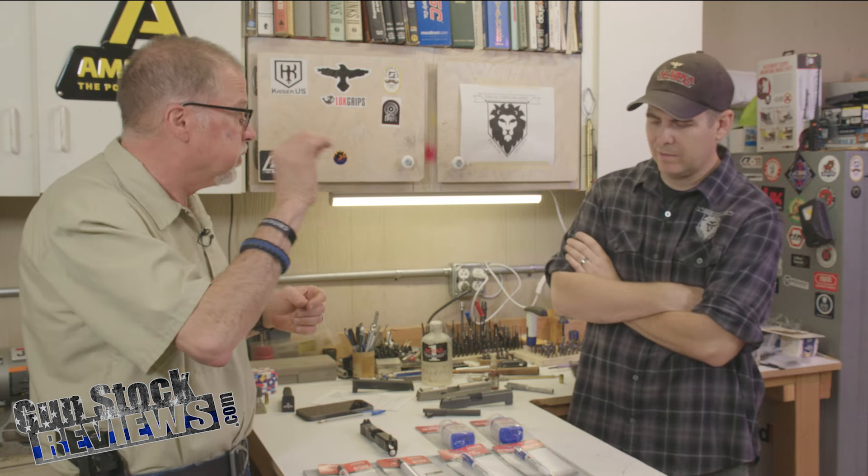I've used the Aluminum Black and Presto gun blue pens a lot. I did a video at the beginning of the channel where I was using a Brownell screwdriver hex and I scratched an AR frame receiver — it was just a little spot. So I went in with it. It's kind of perfect for that, especially with Aluminum Black. But let's say you kind of gouge across it — it doesn't cover anything up. What it does, at least with aluminum, is it has a tendency to just darken the area.